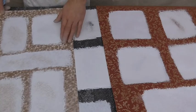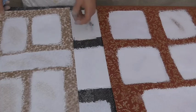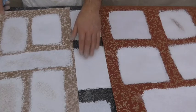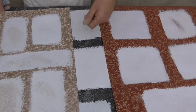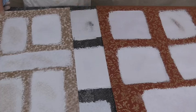If you do get stains coming through, water stains, rust marks, use a spray and that'll help maintain the finish that you're doing, rather than brushing it on. You could roll it again, but sometimes spraying is better. Quicker drying as well.